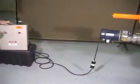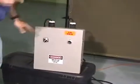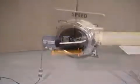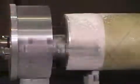With motor speed starting at 0, turn the tool at a slow speed until the cutting insert is cutting 360 degrees around the pipe. Turn the speed to the max position. Allow the cutting head to run out until minimum contact is made with the pipe.